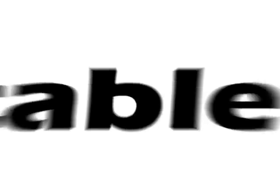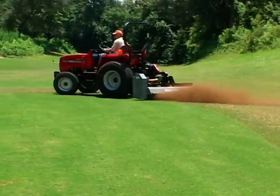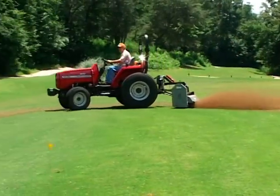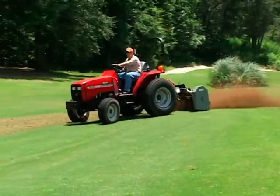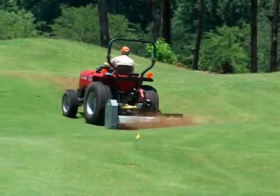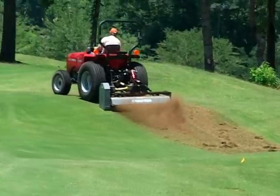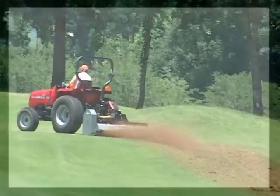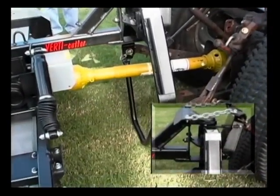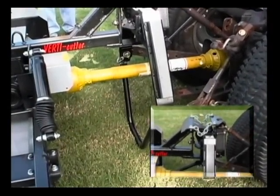The FirstProducts VC-60 has several features that separate it from the competition. A patented lift and trail hitch that allows the unit to turn during operation without ripping the turf. Additionally, a pivot point allows the unit to flex separately from the tractor while on uneven terrain. The patented lift trail hitch features an automatic lock for transporting the unit,